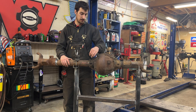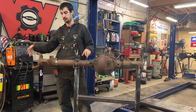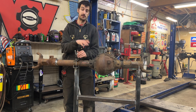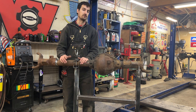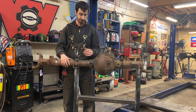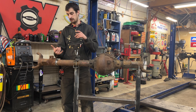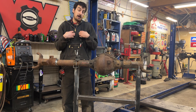One of the first options is to blow out or drill out these rosette welds and press the whole tube and assembly out. I don't do it that way. I've heard of guys that do it, especially if you want the high-pinion center section and you're going to retube it for something else. I think it takes a little more specialty tools, and if you aren't careful, you can damage the center section. A lot of these tubes are machined down for an interference fit inside here, which means you need access to a lathe or machine shop — an additional cost and time. In my opinion, that is unnecessary.